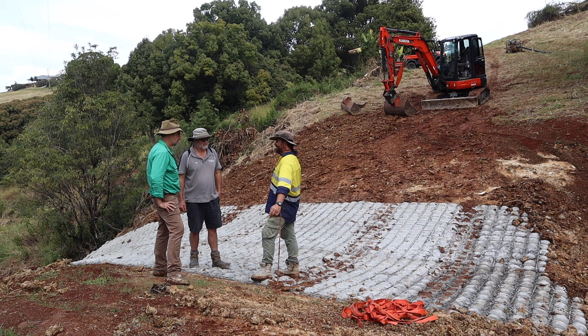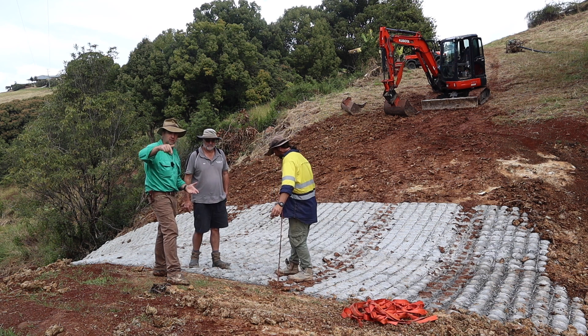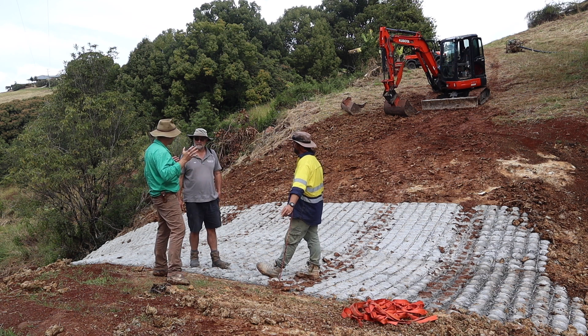The concrete is 40 MPa — you can drive on it the next day after pouring, and after 28 days it's full 40 MPa strength. You can drive a big truck, rollers, anything on it. It's been an absolute privilege coming out here to see the experts put it in and get great tips for using a product like this. It's quick, it's labour-friendly, it's cost-friendly — why wouldn't you do it? If you like this kind of content, don't forget to hit the subscribe button, give it a thumbs up. Plenty more on timthompson.ag — hopefully we can come out and see you at work on another job next time.